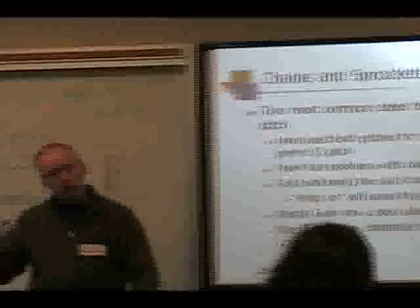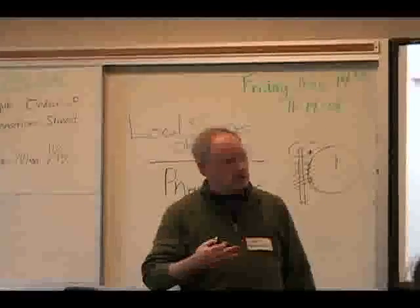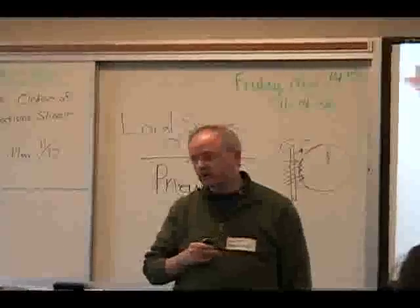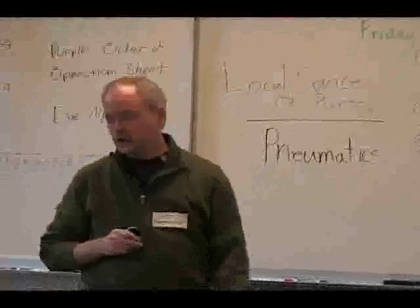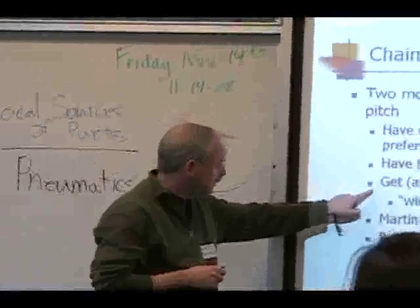The other thing is that with wind up, you'll lose accuracy. If you're using an encoder to count position of something and you've got slack in there, you're going to have a pretty wide variation on your positional placement.